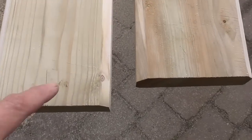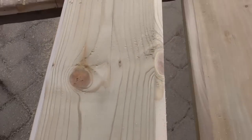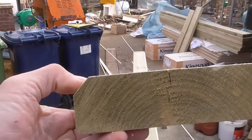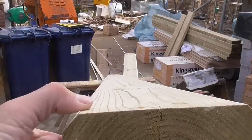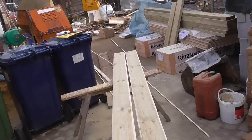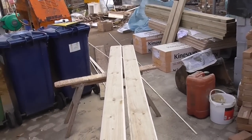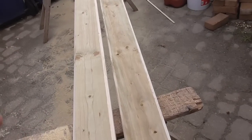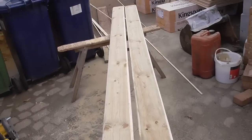There you can see — got a nice little 45-degree waisted section on the back of that bit of timber, and that'll now clear where the flange of the steel meets the web. They're slightly rounded, so we can offer those into that steel now, put one side in first, drill through, then put the other side on, drill through the side as it's drilled, and then we can bolt them up.